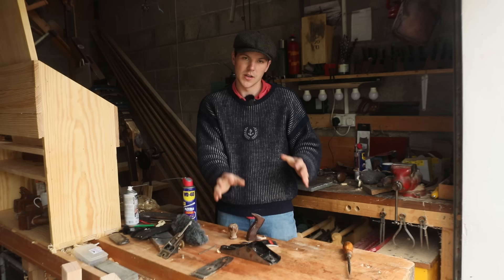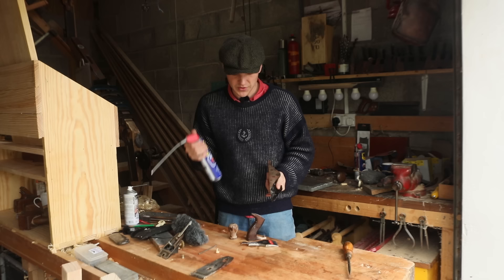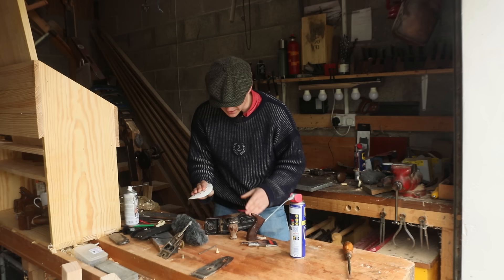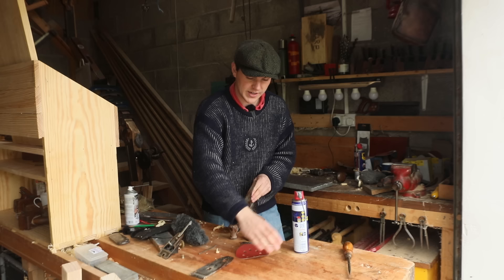The first thing I'm going to work on is the body. The problem with the body is the paint is kind of chipping loose, so I'm just going to crack off as much as will come. Then for the surface rust I like to just spray a bit of WD-40, grab a sanding disc, and just scrub all that off. You can see fairly quickly it makes this gunky rusty WD-40 liquid, and after a few times of spraying it, sanding it, and rubbing it with a rag, it eventually starts to remove itself.